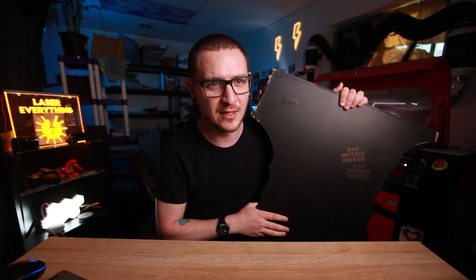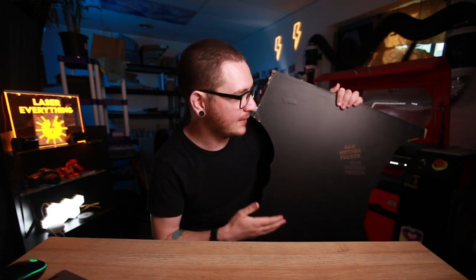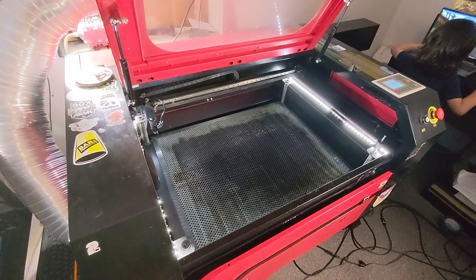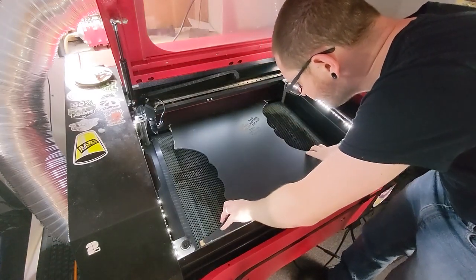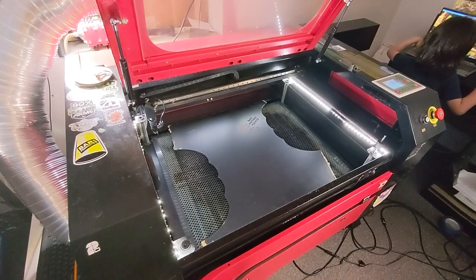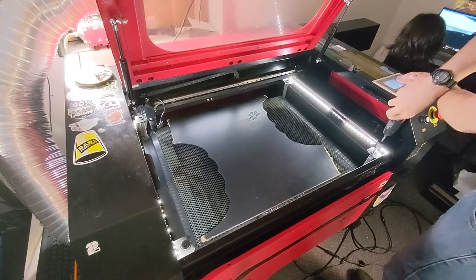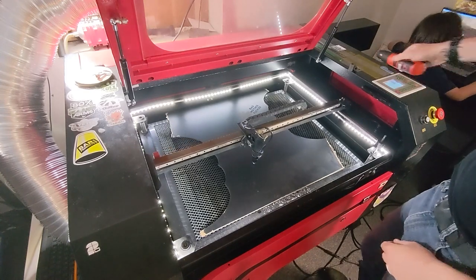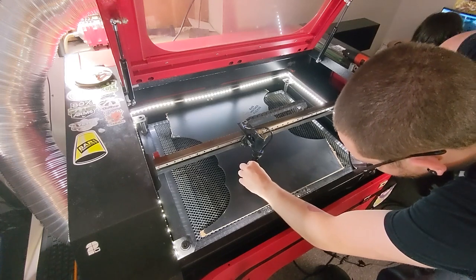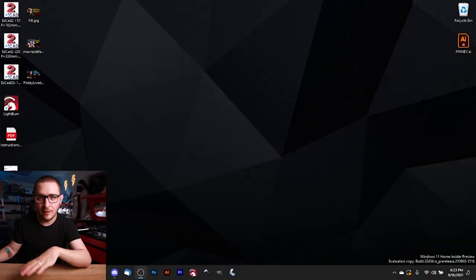They come in big long sheets, I think like 24 by 48 inches. You may need to cut it down. One thing I like to do is slide the whole big sheet into the CO2 laser and cut a line straight across to get more manageable sections. Once you have a manageable section, toss it into the CO2, raise the bed up, and check your focus. It's really important that this is focused correctly, or you won't engrave the MDF right. This is MDF-backed chalkboard, so we want to just break through the top chalkboard layer and get that top layer of MDF showing - that's the perfect mark.